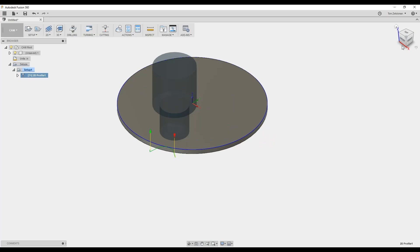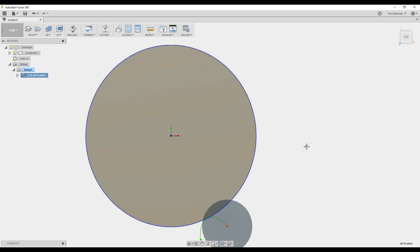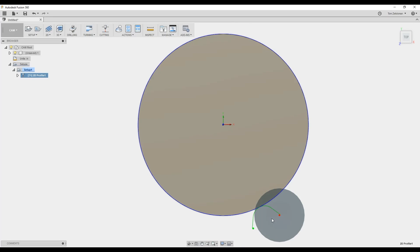From this angle it doesn't show you much, but let's look at it from the top view. The default with Design Edge is to come straight in, go around, and go back out. What I really like about doing this in Fusion is it allows me to arc in and arc back out — coming in on a radius, going around, then coming back through that radius. This helps eliminate the small pip that often appears at the lead-in point, which isn't a clean part of the cut.